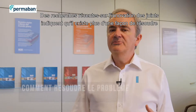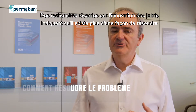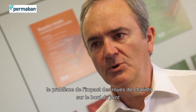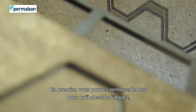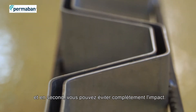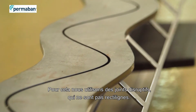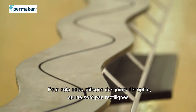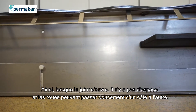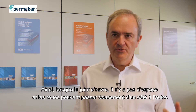In more recent times, there's been quite some innovation in the design of joints. There's more than one way of solving the problem of truck wheels hitting the edge. One is that you can reinforce an edge to be able to take the impact. Another is to try and stop the impact entirely. To do that, we use what we call disruptive face joints, and they're not straight in a line. So when the joint opens, there's no gap, and the wheels will be able to traverse from one side to the other smoothly.